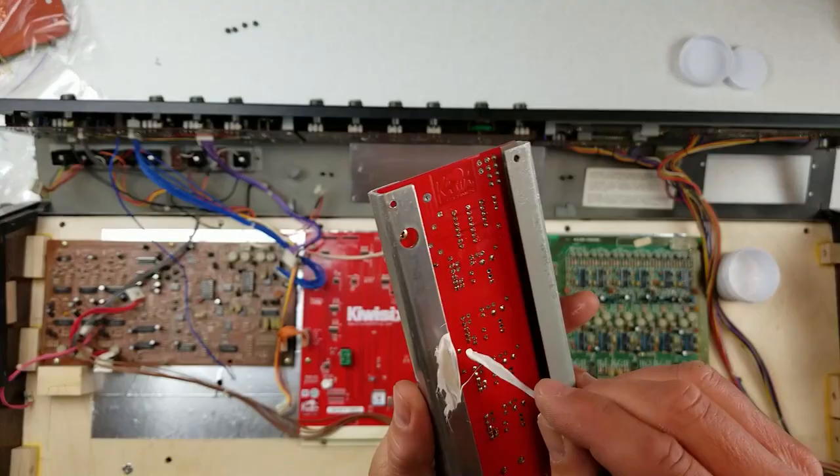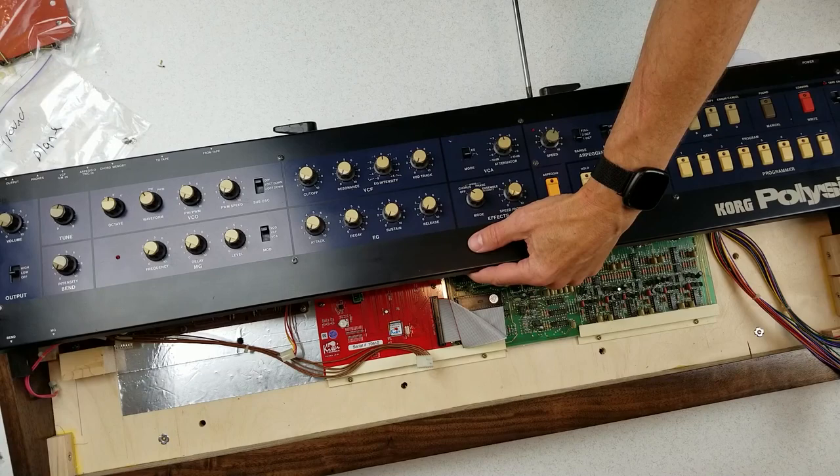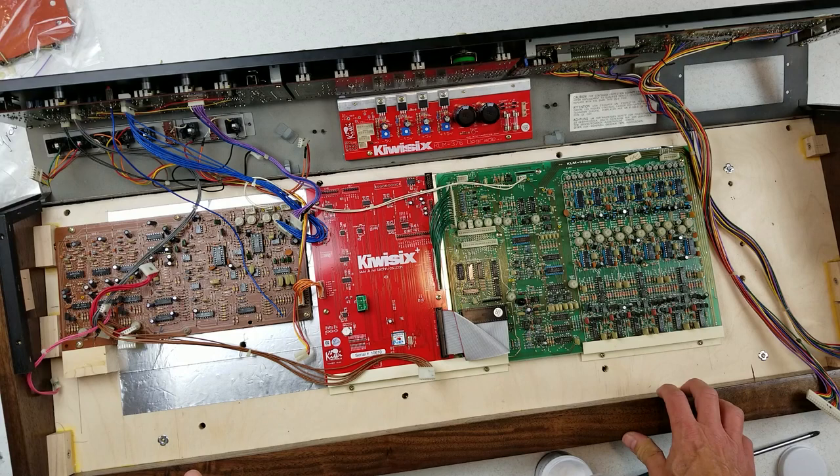It's probably more than I need, but it's better to have too much than too little. The other place where we're going to have heat transfer grease is right here on the top where the transistors and regulators are — it's going to dump all the heat into this, so we want to make sure it transfers out. Now we just have to install this and screw it in place. That's now on there. That was really quite a bit harder than it should have been — I don't know why it was so difficult to get those holes lined up.